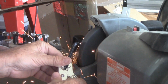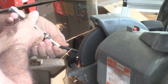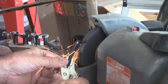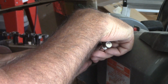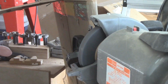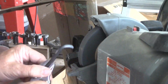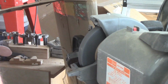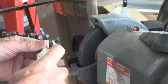I'm starting with the bent tool. The Allen wrench is already bent, but is too long. I'm using the corner of the coarse grinding wheel to cut off the excess length. I'm using a vice grip clamp to extend my grip. With the bent length about right, I'm continuing to shape the wrench into a typical round nose scraper. An occasional dip into water keeps the tool temperature down.